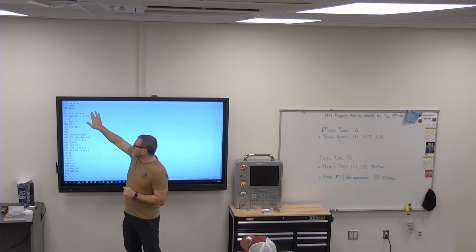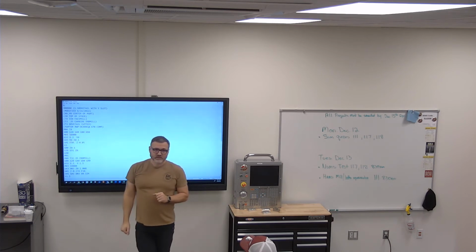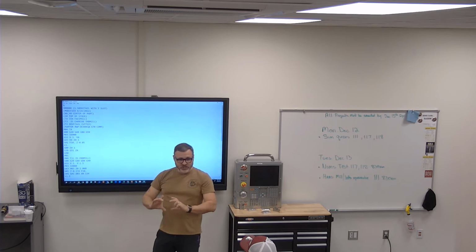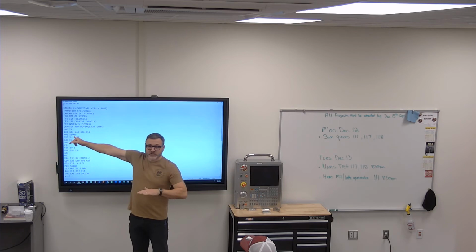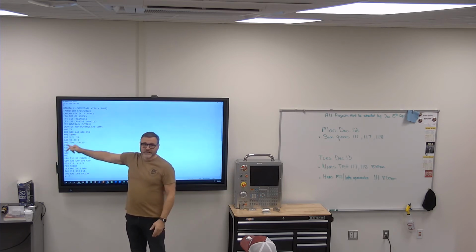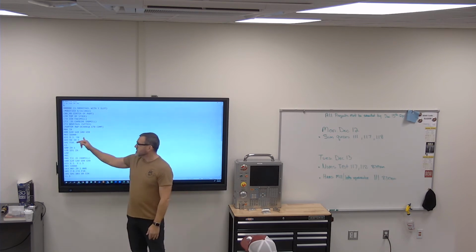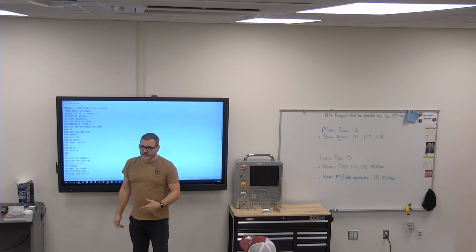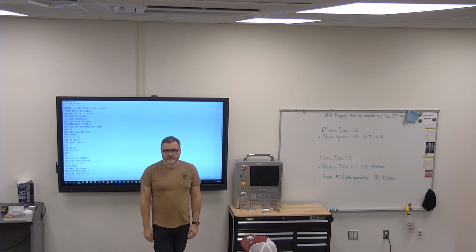See how all the startup lines look the same: G0, G20, G40, G80, G90. Again, it's grabbing these chunks, lather, rinse, repeat. G0 clears out any kind of G1, G2, G3, any feed move that might already be in there. G20 makes sure it's not in metric, in inch input. G40 cancels out a G41 that might have already been left in there. G80 cancels out any canned cycles, drilling cycles, boring cycles that might be in there. G90 makes it absolute programming.